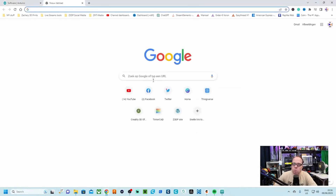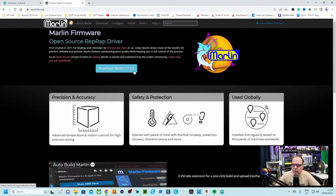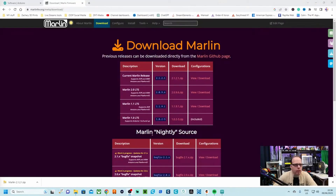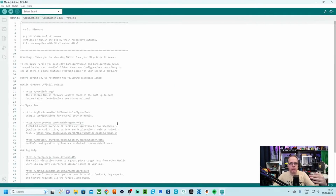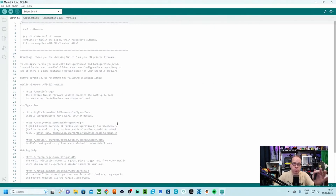So now we are going to Marlin. I'm downloading Marlin 2.1.2.1 — I'll take the current Marlin release. Then I close it, go into the Marlin folder, then into the Marlin subfolder, and double-click on Marlin.ino. That brings you directly into Arduino IDE and you can start using it.